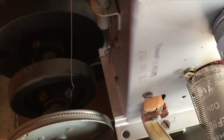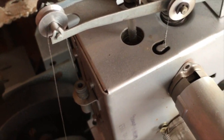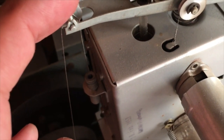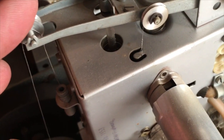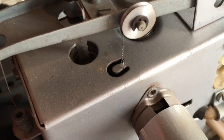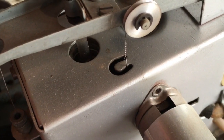And I have found one problem with it already. It was to be expected. This wire is not tuning. When I turn the tuning dial, that wire is supposed to pull, and this is the FM tuning section. This should be pulled down and released to tune into the stations. What you're seeing there is a plunger with some coils on, and that is the FM tuning.